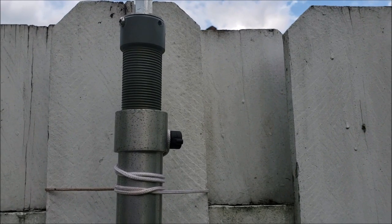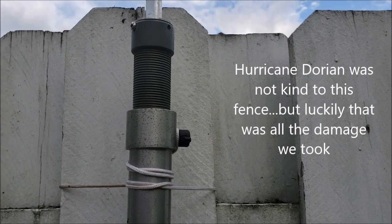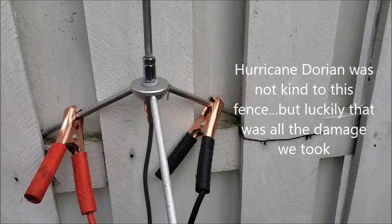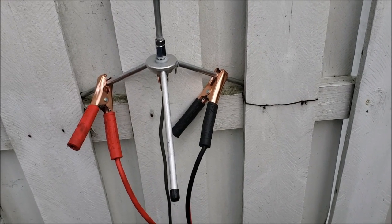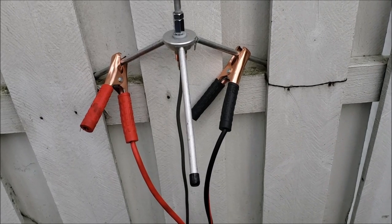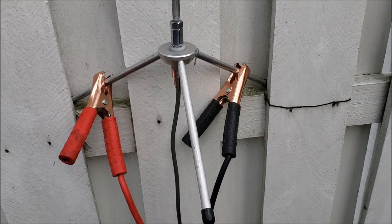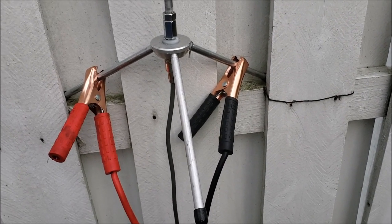The first element here is the coil. It has to be really precisely adjusted for tuning frequency because of how short the antenna is. On the bottom here are the counterpoises — there are three little short stubs which are good for VHF, and I'm going to be using this antenna for HF, so I went ahead and used a little bit of a hack with the jumper cables here. They just go a short distance outward, and they should be suitable for HF transmitting. They're made of nice high-grade copper wire.